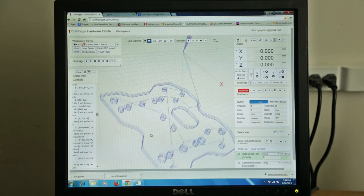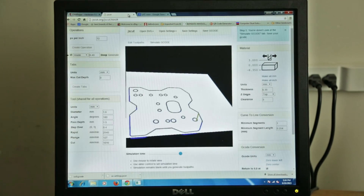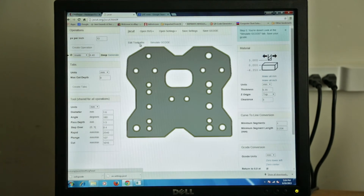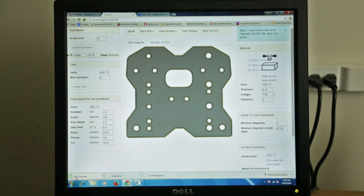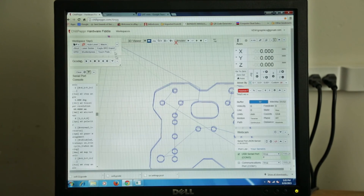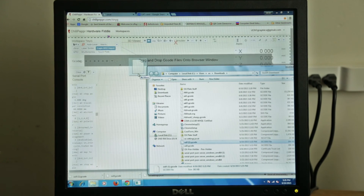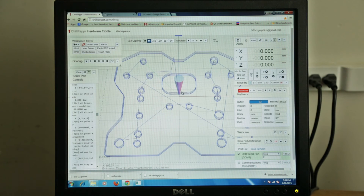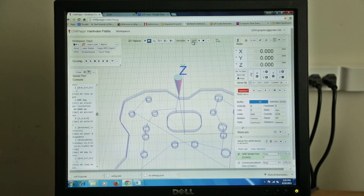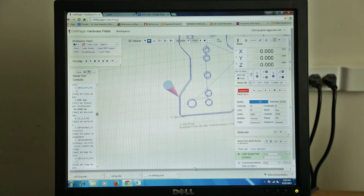There's our parts, but it's homing to the left over there, which is not a big deal. If I wanted it to be at the center, I'll fix it — I'm going to go back over to JS Cut, edit the tool path, and click Zero Center. Then I'm going to click Save G-code and overwrite the one that's there to local — that would be Ox9 with a one in parentheses. Come over here, find that file, drop it, and now you can see that the zero is dead center of the plate.